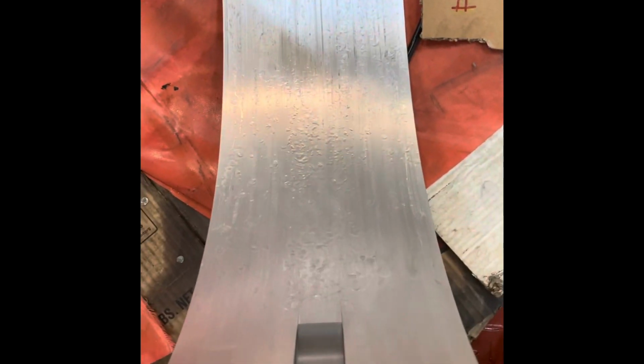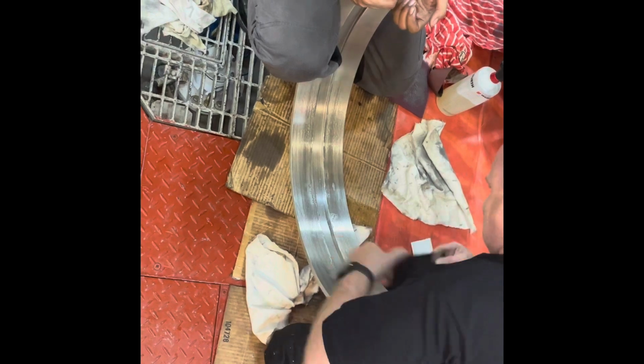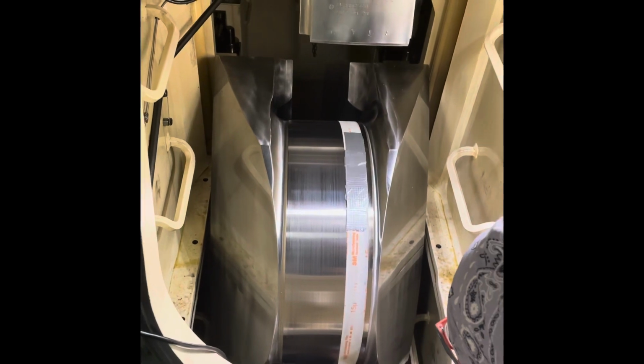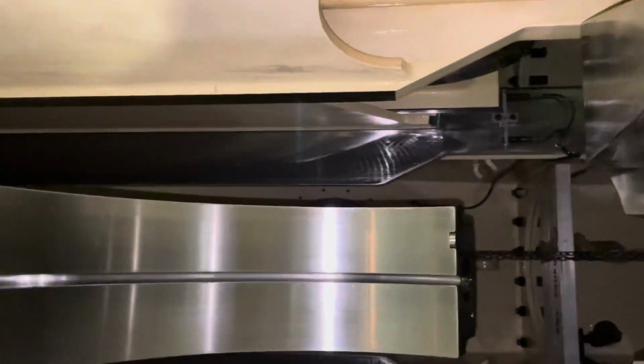This is the condition of my crankpin bearing after the bearing repair. There was damage to the lower bearing also, so the service engineer repaired the lower bearing a little bit. A little scoring on the crankshaft is polished. In my last video on crosshead bearing renewal, I explained in detail how to do the pin polish and how to check the scratches on the pin. Then inspect the crankshaft, connecting rod and the lube oil passage.